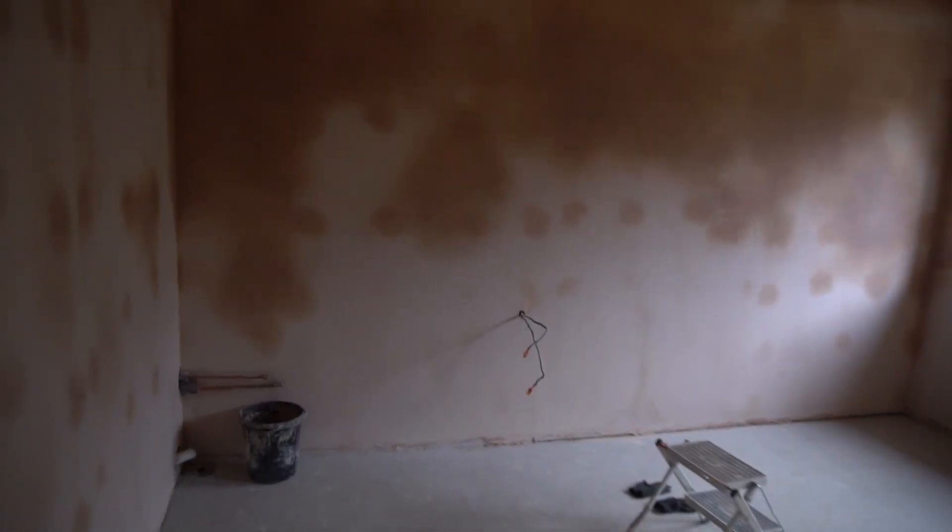As we go through, some of you have seen this before — we've got my garage and man cave off to the left. The first plastered room is our utility room and gym. Nice job done with the plastering; you'll see there aren't many holes for utilities yet. We've got the mechanical ventilation extractor up in the ceiling and I've used these Bead-Master sockets — you can see them in the wall. They have a thin plastic sheet so once it's fully dried I'll cut those out. There are sockets for a kitchen worktop and space for eight spotlights, all pre-wired. We've gone for dot-and-dab; the plan is to render these walls, which was partly a cost and time decision.